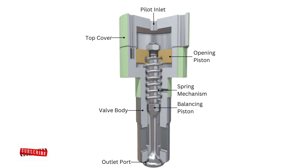Let's see the working principle, step by step. Step one, engine at starting position: the camshaft or electronic control unit sends a pilot air signal, and this pilot air enters the top of the operating piston chamber. Step two, pilot air pushes the piston down: the operating piston moves downward due to pilot air pressure, and this movement pushes the valve spindle downward. Step three, main starting air opens: once the valve spindle lifts off its seat, main starting air at 30 bar enters the cylinder, and this high-pressure air pushes the piston down, rotating the engine.